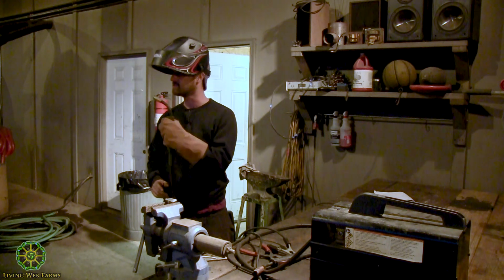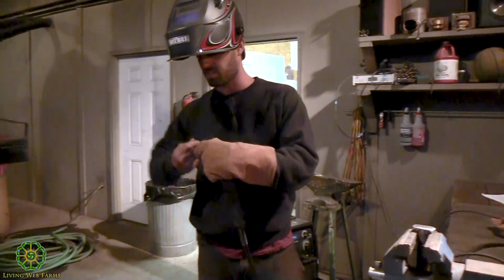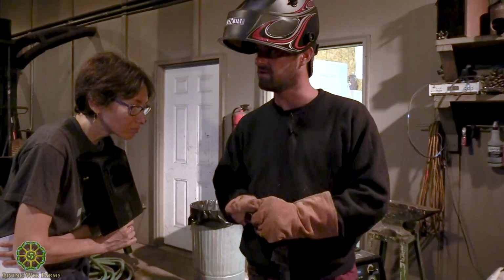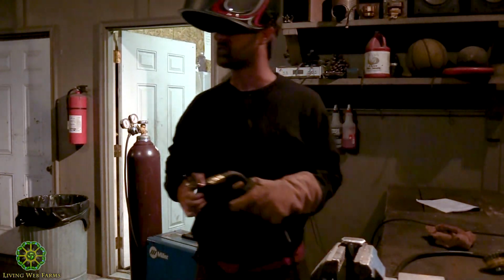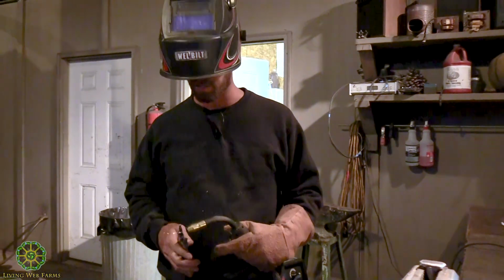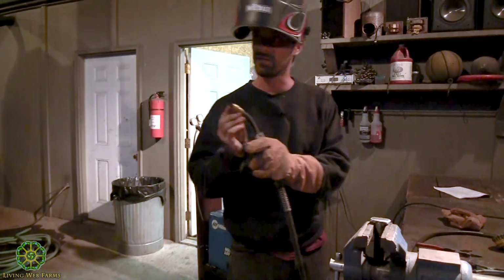Look how that runs a little bit slower than the other one. That's a much different material, because you see it's a lot harder for me to snap it off. You can tell it's not hollow. I can bend it all around. A lot of times when I'm working with the flux core welder, I might leave it on for a second and just snap it off with my fingers, but with this one, you pretty much always need to have your little pliers around. Again, I snipped it about 1/8 of an inch right there.